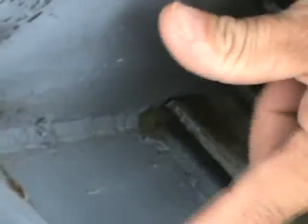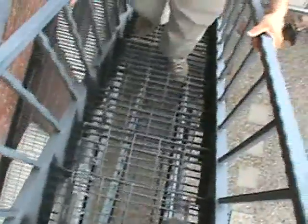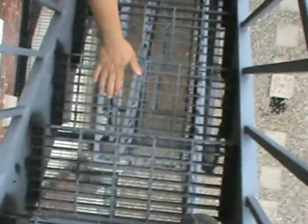We have all welded fire escapes. So this connection here, and it's easy to do from this side, needs a clip, an angle, and bolted here and bolted there, and then seal all the way around. These treads were done 3 to 5 years ago. They look good. This was an afterthought. 5 years ago, this fire escape was treated. This was an old welded fire escape, and this fire escape was spot repair only. And some of the treads now have bolts, and they were sealed properly.